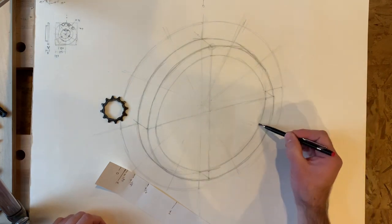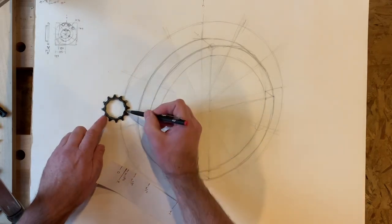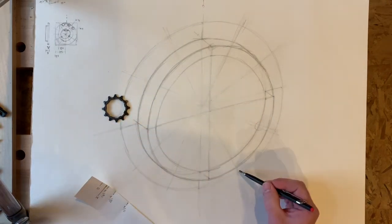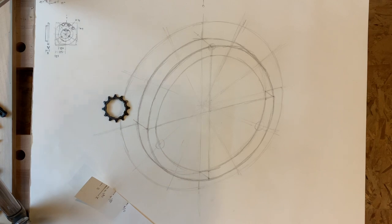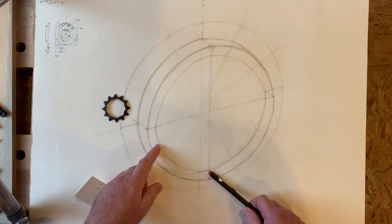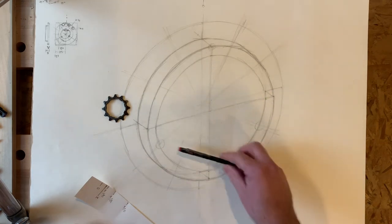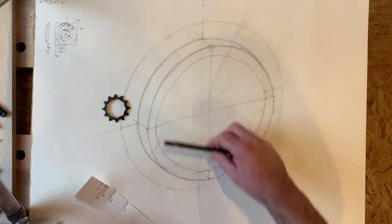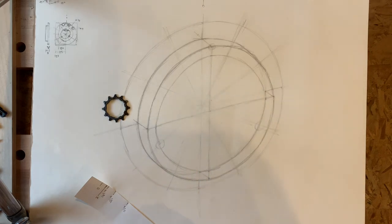What I want to do is draw another ellipse, which is the internal spline. I've previously measured this — it's about an eighth. So from an eighth to a quarter, or from zero to an eighth, however you want to do this. There's our inner rim — this will be where the splines live. If this is our top point, we're going to have a spline — the little tooling holes — at noon. Then one, two, three at four o'clock, and again at eight o'clock. So there are our three places where these gouges are going to live.